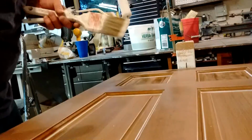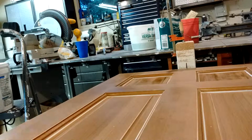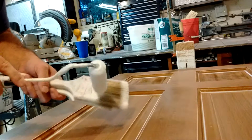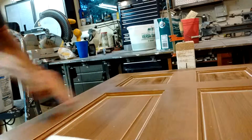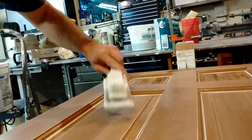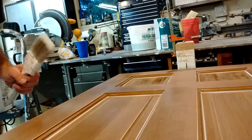And what I'll do coming out of the bucket on that is I will dip my roller, get it loaded up, and then hold it like this on top of the big brush. So the big brush accumulates a little bit of paint here, and I can set it down so the paint doesn't dribble on the edges and stuff, and I can just smear whatever paint got onto my big brush here. You want to make sure you don't go too low or you'll scratch it with the ferrule, and then you get a nice roll out here.